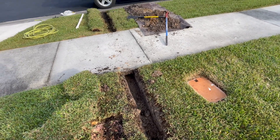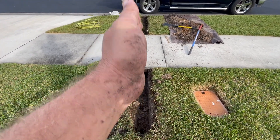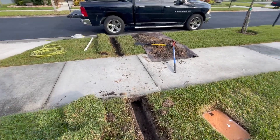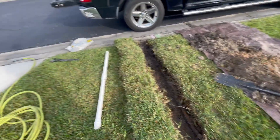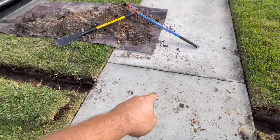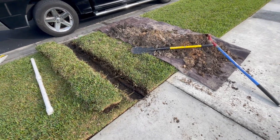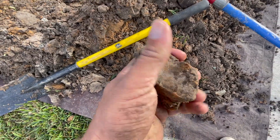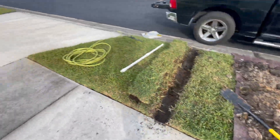Went ahead and started on this front area. Whenever you're trenching under sidewalks, try to stay in as straight a line as you can. Keep a good steady slope — almost level is honestly the easiest when you're digging it, and afterwards you can reshape it and make sure you have good slope. We are going to be hydrojetting it, so being level makes it a lot easier. Some of this is nice soil, some is super thick dense clay — might have to get the pressure washer out. We usually don't bring it because our little tools are usually enough just ramming it slowly. Plus, we don't want to take off too much underneath that slab and cause cracking later on down the road.